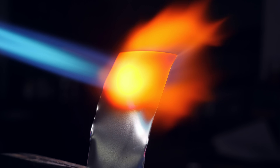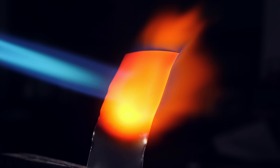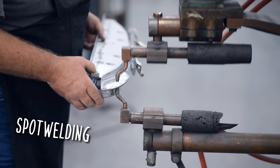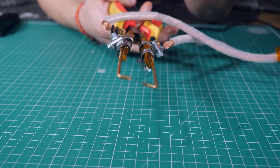It's super light and thin enough to cut with a regular pair of scissors. Even though it's pretty thin, it can take heat pretty well, so I was thinking I could use this to make a Pulse Jet engine. I'm not very good at welding, but there's a type of welding that even I can do — it's called spot welding. Spot welding is where you weld thin sheet metal on just a spot by passing a high current through it. Using some pliers and brass rods, I made one myself and it works.